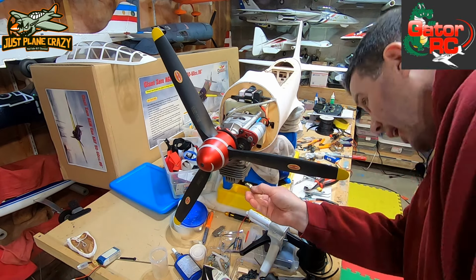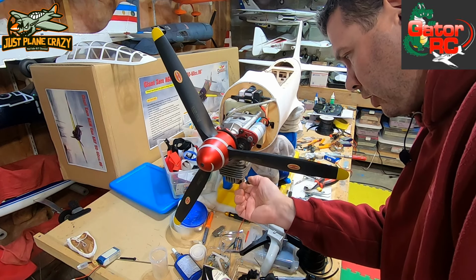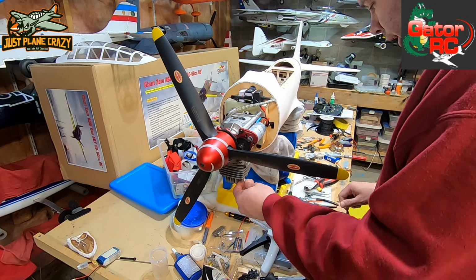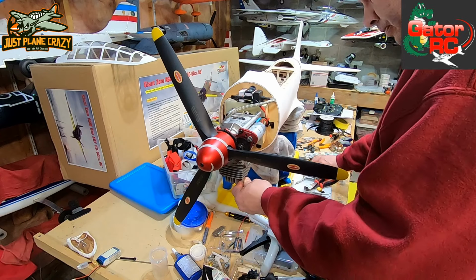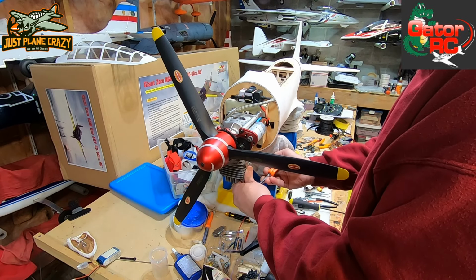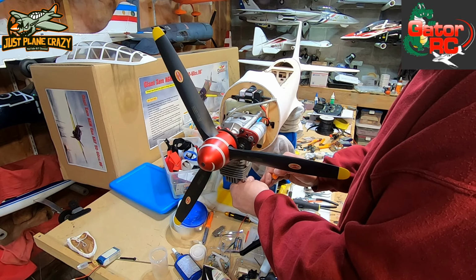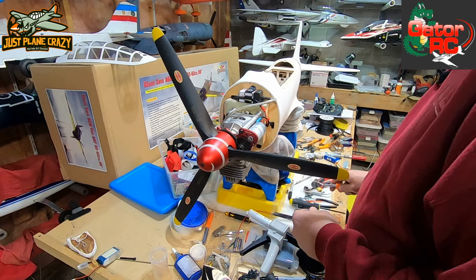We are going to go ahead and throw that spark plug in, start it by hand to make sure it doesn't cross thread, and you only need to tighten this up to the point where you crush and seal that gasket. It does not need to be super crazy tight because you are threading it into aluminum and you don't want to pull it out.